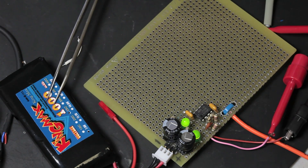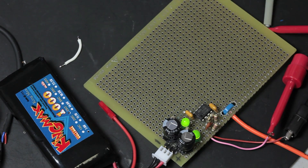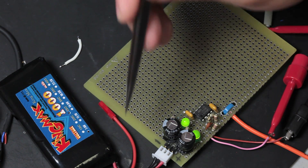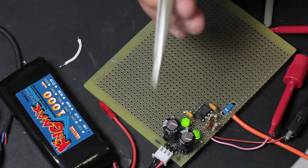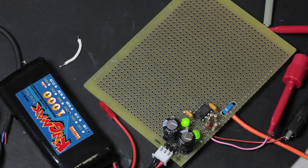This battery makes a really cool bipolar supply because it comes with this funky charge jack — all the multi-cell LiPo batteries do. The middle pin gives you like ±3.7 volts, or ±4.2 when fully charged.